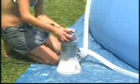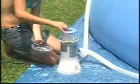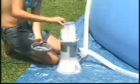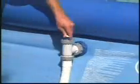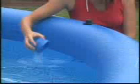Maintaining your pool and keeping it clean is important for sanitation and the life of your pool. Remember to check the filter cartridge every 2 weeks to see if it needs to be replaced. First, turn off or unplug the filter pump and either close the valves at the connectors, or if your pool does not have valves, plug the connector holes with wall plugs.